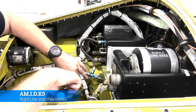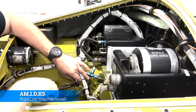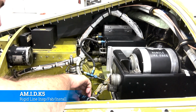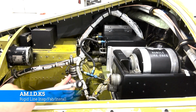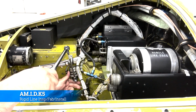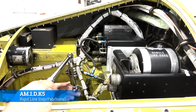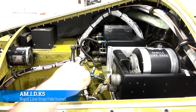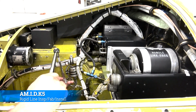Now, torque wrench is really important. If you over torque it, you have a really good chance at breaking something, because remember, this is aluminum, it's soft, just like we learned in our metallurgy lecture. But if you under torque it, then you're going to have a leak. And this is a de-icing fluid inside an avionics bay. It will not stand to have fluid floating around a bunch of computers and things like that. That can be very expensive. And if you under torque it, it might pass a leak check, but then fail in flight, which would be a really bad time to have all your auto flight systems go out.